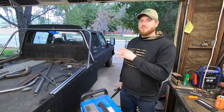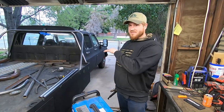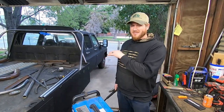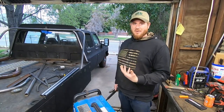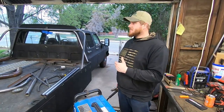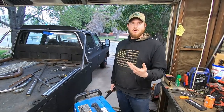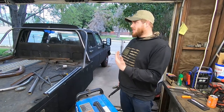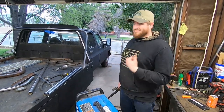Now that I'm pleased with both the primary and secondary tubes for our hoops, I'm going to lay in our horizontal window protector. It's basically a bar just to make it so that any payload that might slide forward isn't able to hit the back window without having to hit that tube first. So we're going to be using the rims from what we cut off already, and we're going to be doing the same technique that we used before to mate the two pieces of tube, and then we're going to notch them to fit in below the back window horizontally. So let's get on it.